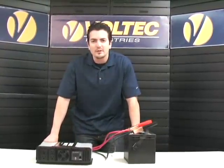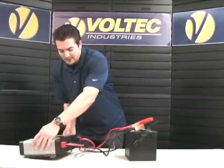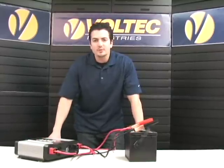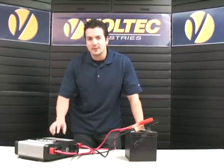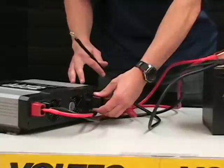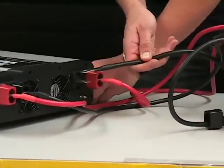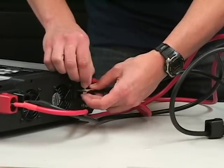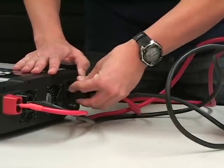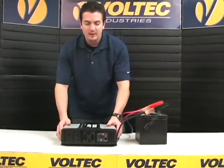Now I'm going to show you how easy and simple it is to connect this inverter. As you can see, we already have our negative and our positive cables connected to our battery and also to the back of the inverter. Our 1000 watt and our 1500 watt models come equipped with one negative and one positive. Our 2000 watt and our 3000 watt models come equipped with two positives and two negatives. I've taken the liberty of leaving one of the negative cables disconnected to show you how easy and simple it is to connect. Remove the terminal protector that the inverter provides for you, slide it through the negative cable, put your negative terminal on top of your inverter terminal, slide your screw in. Once tightened, slide your protector back on. When connected, turn the unit on and you're ready to use your inverter.